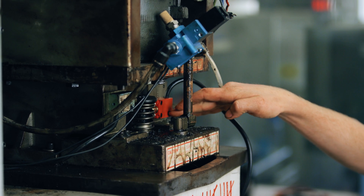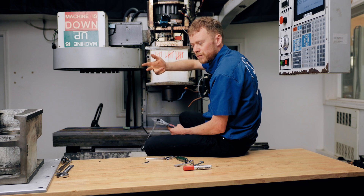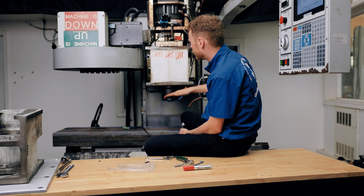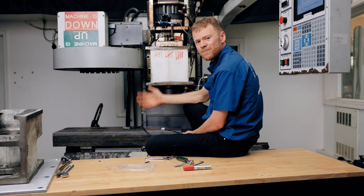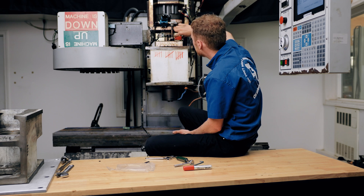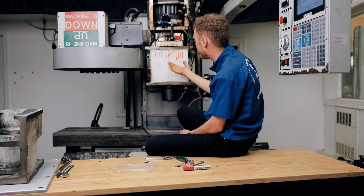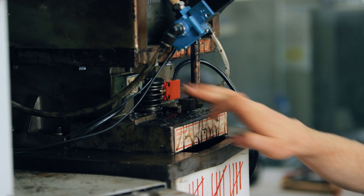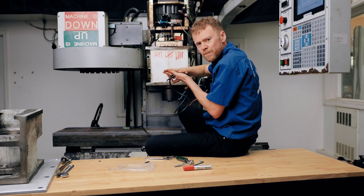There's bracketry on the bottom. If you watch the timing before, you want it to go 0-1, 0-0, 1-0, 0-0, 1-0. There's a procedure — correct height above, and the correct push out. That's more important if you're running a machine that has through spindle coolant on a belt drive machine. The orientation of this unclamp switch is really important, because when you activate through spindle coolant on a belt drive machine or gearbox, the pre-charged solenoid pushes it down. It wants to see this one go off and this one go off, knowing it's just touching the top of the drawbar where the two carbide seals meet.